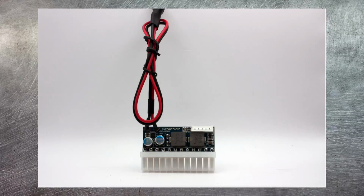The next thing is to provide power to all of my disks, and to do that I'm going to be making use of this. It's a Pico power supply. Now you can use these to actually power PCs. This is a 160 watt version. Now you can see that all of its circuitry is exposed there, and you may feel this is really dangerous. However, the great thing about Pico power supplies is that everything is low voltage. They take in a 12 volt power supply, and then make available both 12 volt and 5 volt supplies to all of our devices.